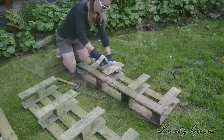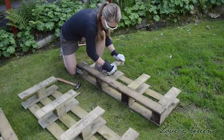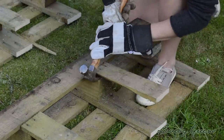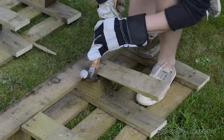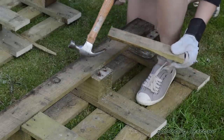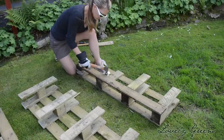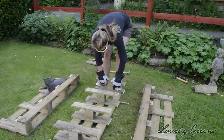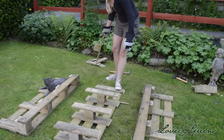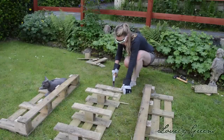So the first thing is pulling off those little slats that are on the back. You don't want to break them, and you don't want to saw them, because we're going to use them later on in the project — so gently pry them up. Any nails that are exposed, just make sure to hammer them in; you don't need to remove them. Next, pull the center pieces off and set those aside. Those blocks that you see being pulled off are going to be the feet later on.